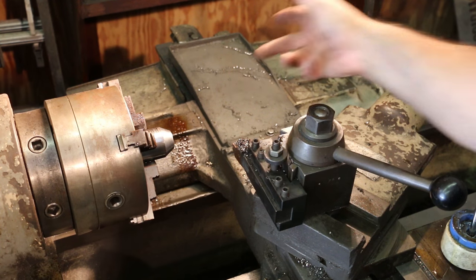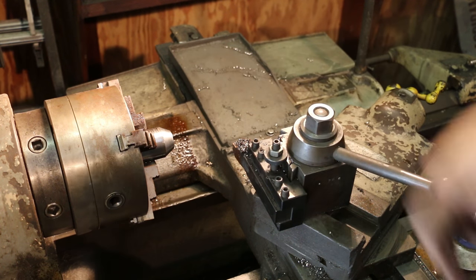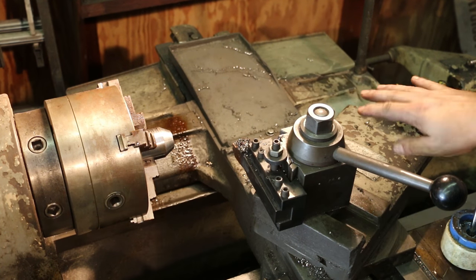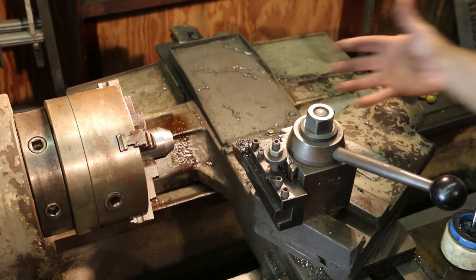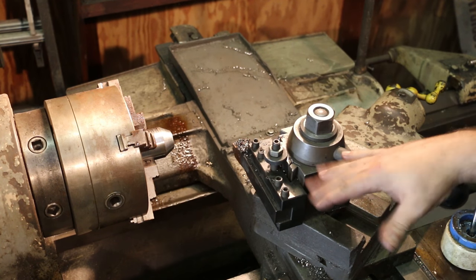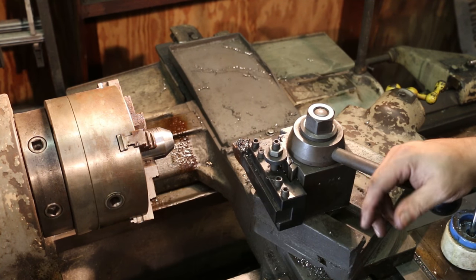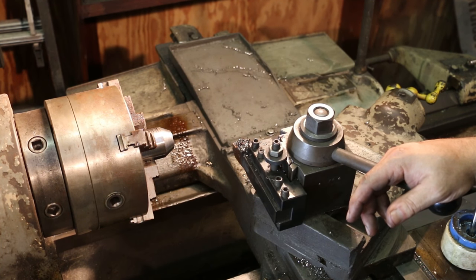The last step I want to do is put a little dimple in the end for that set screw to go into, but because of the way I have my compound set at this angle back here, I really can't get in behind it with a drill. So I'm going to go ahead and make all eight of these first, and I'll come back at the end and we'll do another setup and just put a little dimple there for that set screw to go in.